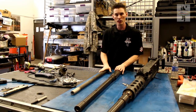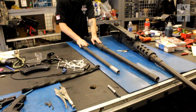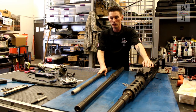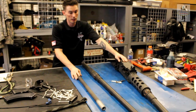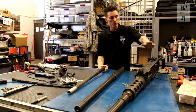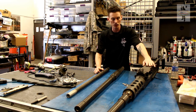I went ahead and got out an aircraft model barrel to give you guys an idea of what I'm talking about. Side by side — this is your standard M2 barrel, and right here is an aircraft model. As you can tell, it's considerably shorter. The profile is a lot thinner; everything about it is lighter and smaller. Because the action and the barrel are so much lighter, it increases the cyclic rate of this weapon considerably — enough that if fired on a tripod, it can do a complete wheelie, bringing the front end of the tripod off the ground. Being that it's thinner, you cannot have the same burst length in terms of how long you hold down the trigger. But if you put this barrel on an older M2 with the smaller buffer on it, it would eat the gun apart — it would just beat itself to death. This gun is actually capable of handling that.